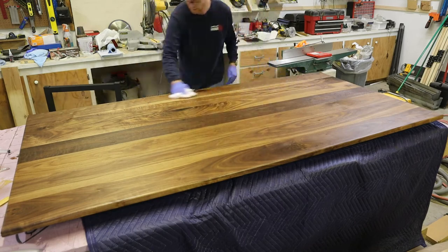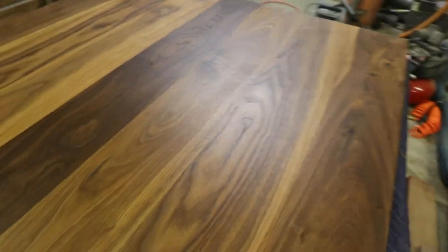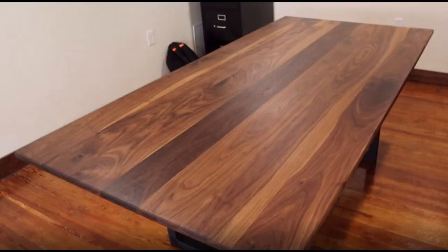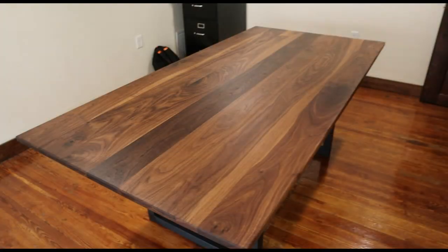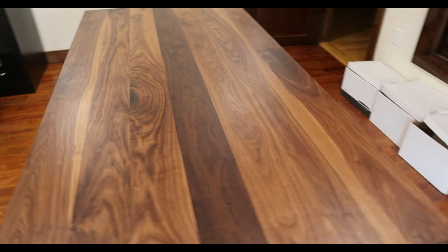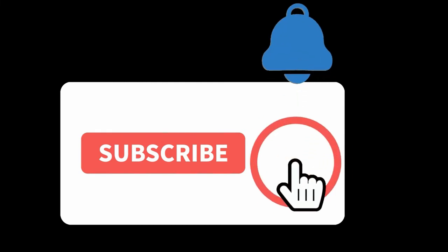Now I want to show you something I'm pretty proud of. When I lined up these boards for the glue-up I paid attention to the orientation of the grain — where the grain matched up with the board next to it, the seam between planks becomes almost invisible. Where the sapwood came together I matched it with sapwood; where the cathedral grain lines came together I matched cathedral with cathedral. Here is the table after install in the customer's office. The customer was very happy and very pleased. I was too, even though the look was completely different from what I originally imagined — I wanted all heartwood, but instead about 90% is sapwood. In the end my customer was extremely happy, which makes me happy. Please subscribe and like, and I'll see you next time.